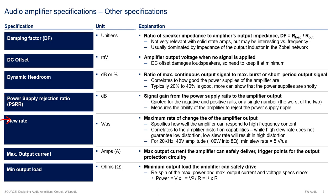The slew rate, measured in volts per microsecond, is the maximum rate of change the amplifier output can have, and it measures how well the amplifier can respond to high frequency content. There is a big debate on how much slew rate your amplifier should have to achieve good distortion. In my experience, while low slew rate will give you high distortion levels, high slew rate does not guarantee low distortion. Therefore, when we cover input stages, we will do an experiment to show how much slew rate you actually need. Maximum output current, measured in amps, is the maximum output current the amplifier can safely deliver; in a properly designed amplifier, this will be determined by the trigger points of the current limiting circuit. Finally, minimum output load, measured in ohms, is the minimum impedance load the amplifier can drive.